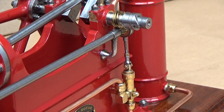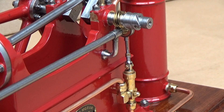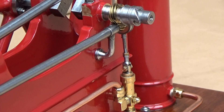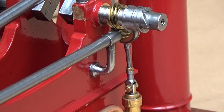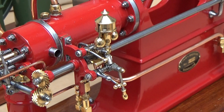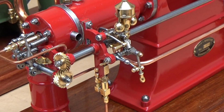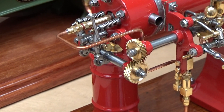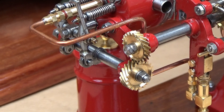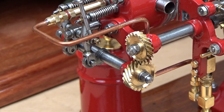The two engines are more or less the same in construction: the water pump connected via an eccentric to the side shaft, the governor-controlled injection pump system, but a little difference is the gear wheels connected to the overhead camshaft.